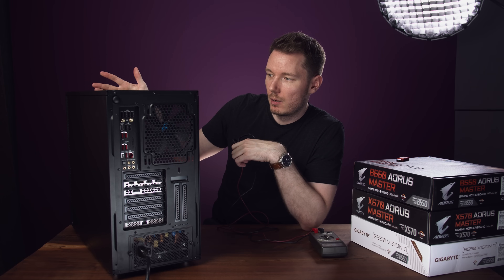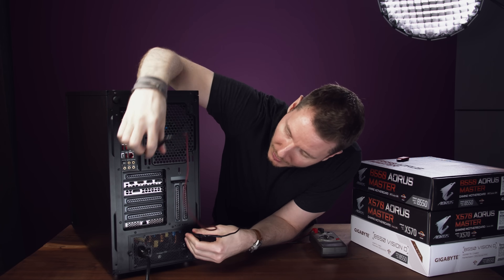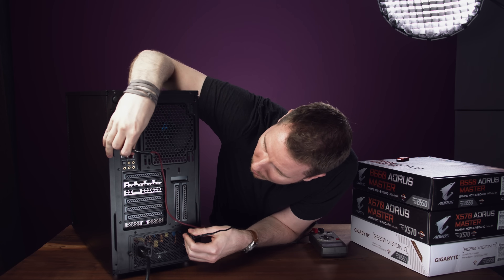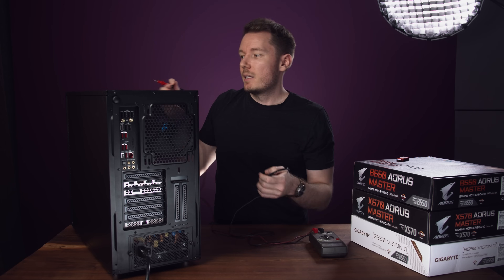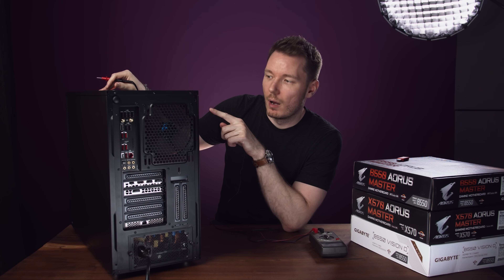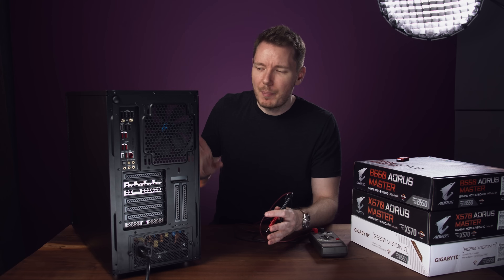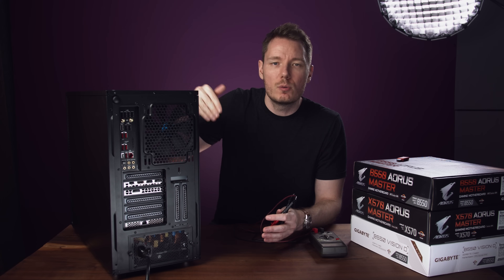For instance, if I turn this on — OK, it's booting up now. I'll do the exact same thing... as you can see, or as you can hear rather, it's not beeping anymore anywhere. The same thing happens if you touch one of the standoff screws on the motherboard or basically anything safe to touch internally. When the computer's off, you'll get a continuity beep, but when it's on, you won't. I think the motherboard might be grounding differently when it's on versus off and using a different path.